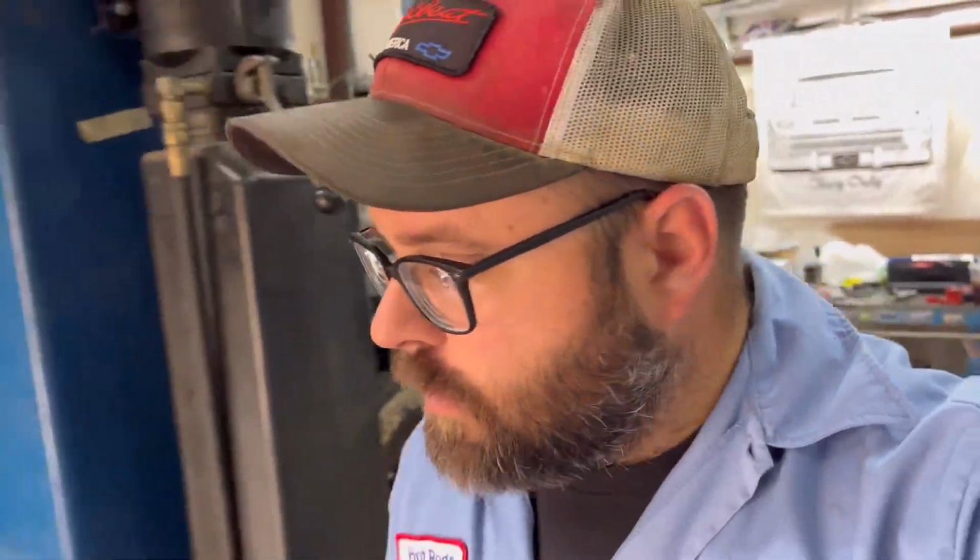We're back out here in the shop working on the FJ still. It's been a couple weeks, more than a couple days, but I've been underneath this thing and I've been trying to mock up the new piece. I'll show you guys what I got going on real quick. We're gonna have to trim it a little bit. And then we're going to start grinding down the frame, trying to get some clean metal. That way we can buzz this thing on there. And then hopefully we can get it all painted up. I'm hoping maybe to have it done today, but not 100%. Might be another day or so.